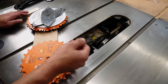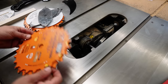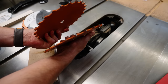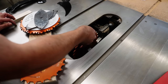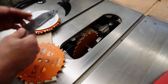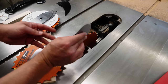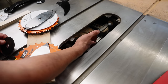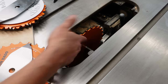When stacking onto your arbor, a couple of important things to remember: first, remove the riving knife — you're never making a through cut with a dado, so you don't need it. Second, your blades have a specific side: 'this side out right, this side out left' — the important thing is the teeth are facing you. Also, if you're using shims, don't stack them all between one chipper and one blade. Alternate where they go, and make sure shims are all the way on and not caught in the arbor threads.